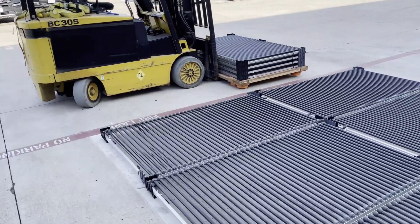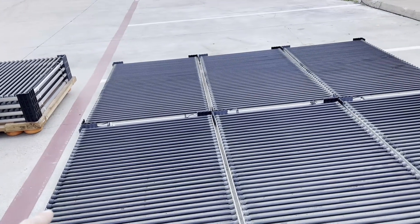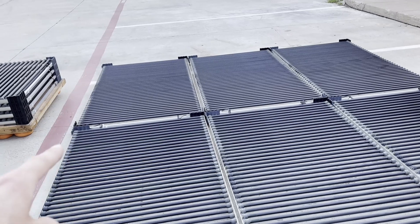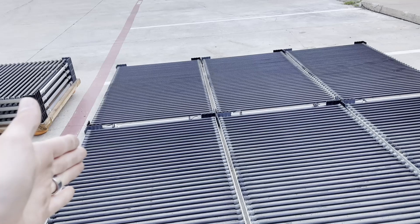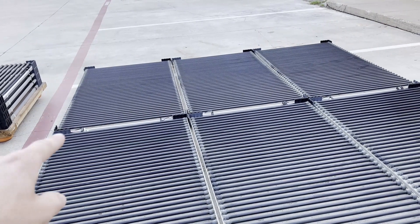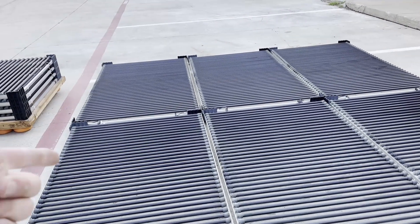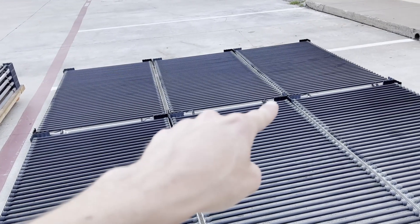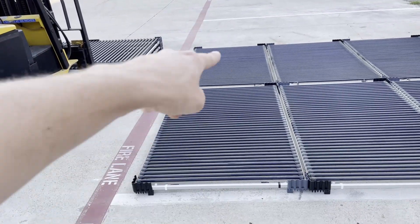Putting together one of these arrays is actually quite simple. If you think about each of these individual tubes as being a 92-volt solar panel, then this here is going to be all the same — like your negative — and this here is your positive. So that connector right there gets connected so that it continues up. That's all the same potential, same voltage. Do the same with that connector, and that one, and that one. So that essentially makes it so that this is one big panel.